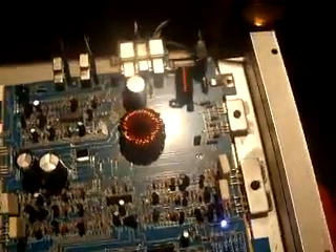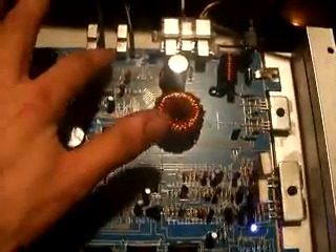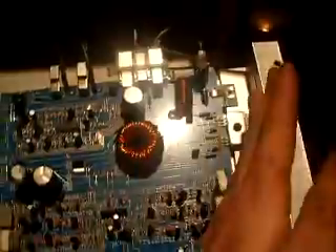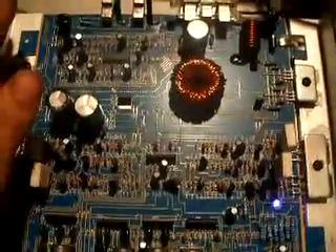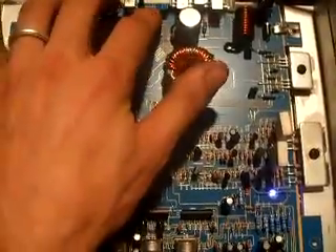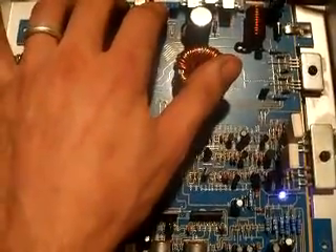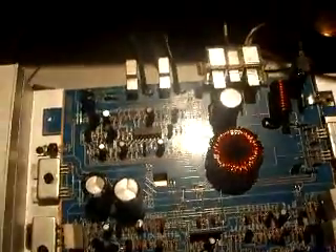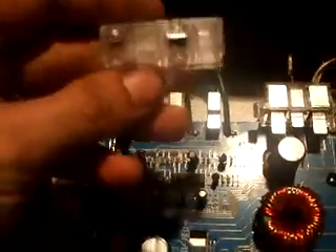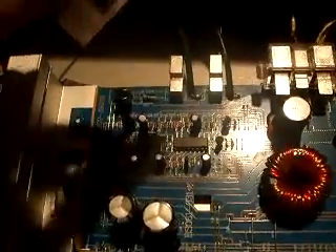The first thing I noticed is — I soldered two wires here — because the amp is actually, based on the way it's laid out, a stereo amp. They just gave you the bridged outputs. So the amp's actually stereo; there's the grounds, but they didn't have those hooked up on the stock header that comes out of the side of the amp — they're capped off. So technically they've just marketed it left and right and it's bridged.